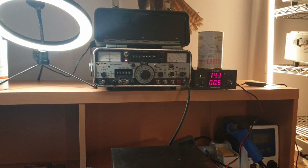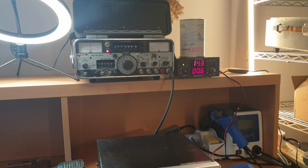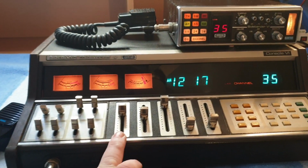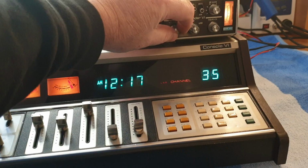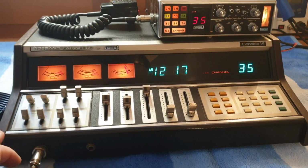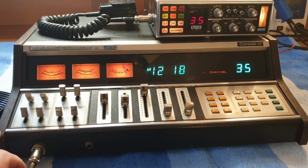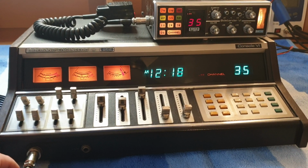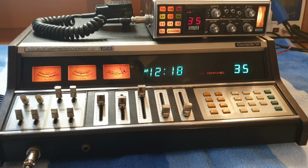Now, I'm on one of our other benches today. This one's a little bit sparse in the fact we just got it on an IFR 500S and a little power supply. This one is actually 240 volts. Let me just turn that down. This radio was factory delivered 240 volts down in South Africa. And of course down there, they're 220, 230. So 240 is definitely quite okay, which means no clock modification required on this one.